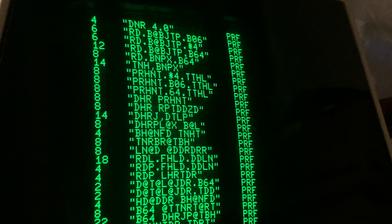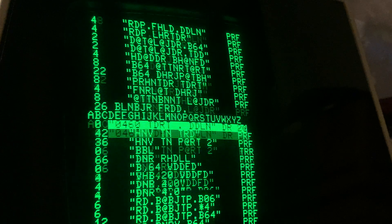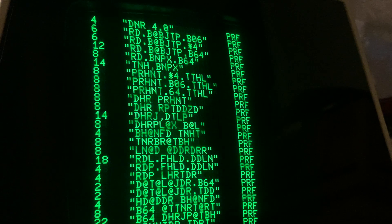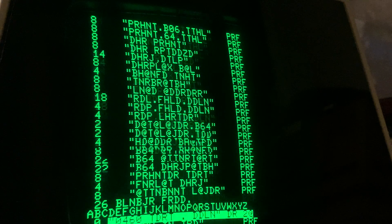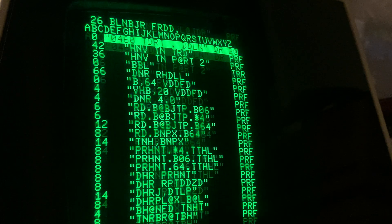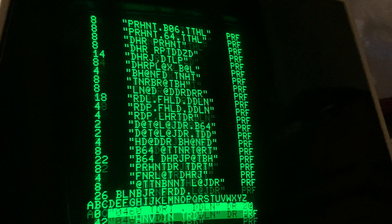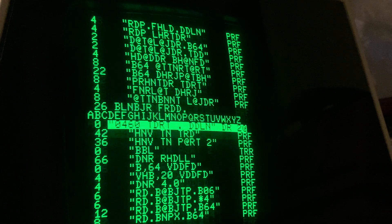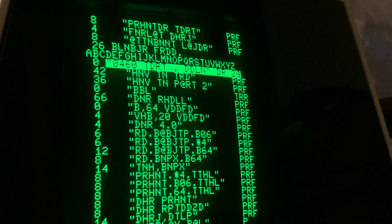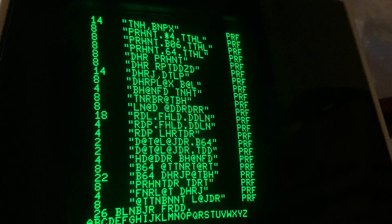So we're really getting down to the point where it's got to be something with the computer — something very strange. I guess what I've got to do is get another similar computer up here. I'll have to do some chip swapping and probably some desoldering, socket some things, and see what's what. My gut tells me it's probably one of the — I lose track whether there's one 6520 and two 6522s — but I suspect it's one of them.